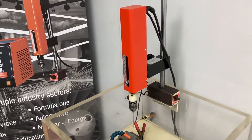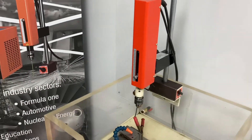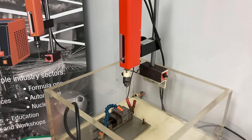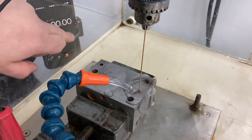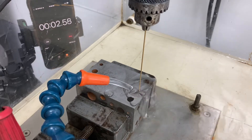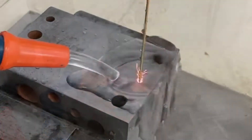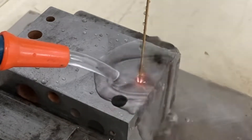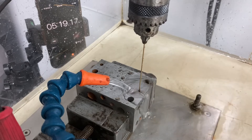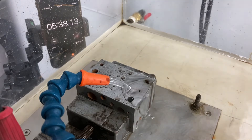You don't have to have the head perfectly vertical like it's shown here. If you undo the bolt at the back, you can get 30 degrees of rotation on the head as standard. However, if you can get it securely fastened and get a good flow of dielectric over the part you're trying to erode, there's no limitation to the angle that it can spark at. There's no danger.